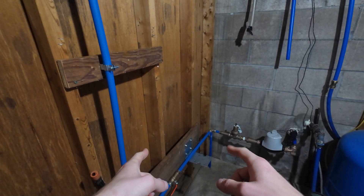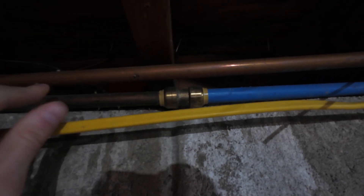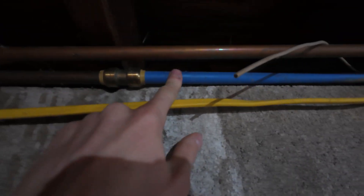Let's see where they actually grounded. The water is on the other side of the room. There is a ground — but this is a gas pipe. A gas pipe isn't grounded, but we have the ground coming in and then it looks like the first point of contact with the water system is right here. That might be why we have a poor ground connection. You can also see we have a mixture of metal and plastic piping — plastic is insulating, so that might be why we have a bad ground connection.